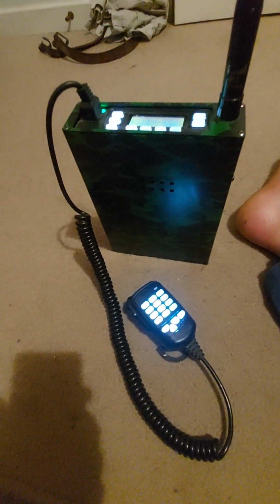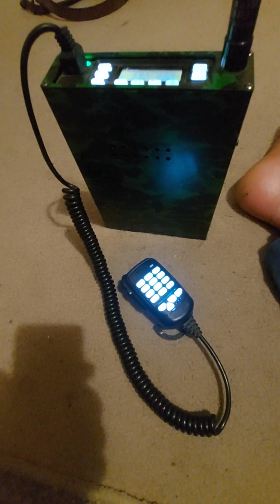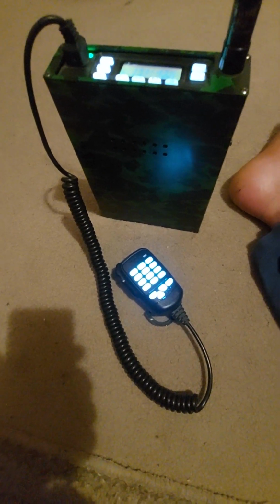And it does change the feed point impedance, the geometry of the antenna, but it is a high impedance antenna, 2,000 to 5,000 ohms. Important note here: on certain frequencies when running power in excess of, let's say, 300 or 400 watts, if you're running 1,000 watts, the end of the antenna could have up to 3,000 volts on it. That's why we use insulators, guys.